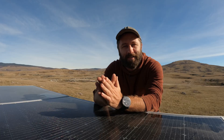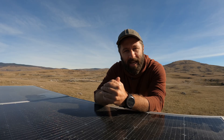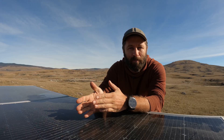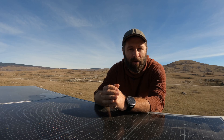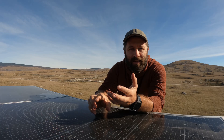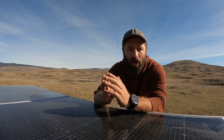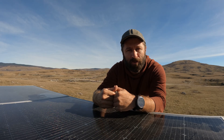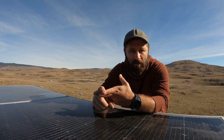You may be asking: why do you need 2200 watts of solar? Well, after having 750 watts and adding an AC unit, it made us see that 750 watts was not enough to keep our batteries charged and still run the AC. This 2200 watts allows us to run AC, our Starlink, and all our electronics without worrying about power. We both still work on the road, so we do consume extra power with our laptops and running Starlink all the time.